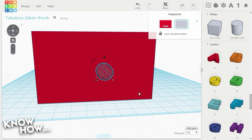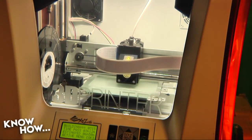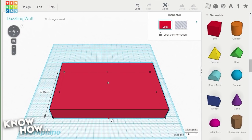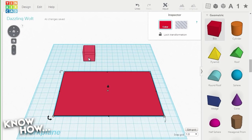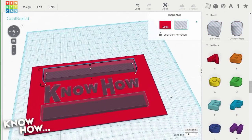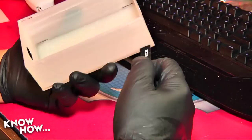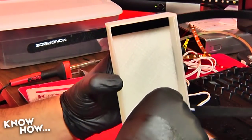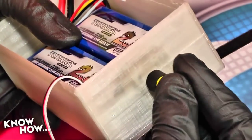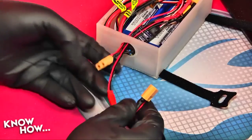I added slots to the bottom and top of the project box so I could run Velcro fasteners through them, and a wiring exit through the rear. A single hole through the front of the box would be where I attached the servo tester. I also made sure there was a lip for the box big enough to fit the lid. While the project box printed, I created a lid — a simple design of two boxes stacked on top of each other. The top box was 1mm high in the dimensions of the outside of the project box, while the lower box was 2mm high in the dimensions of the inside. We could stop there, but I decided to add a little flair just for giggles.